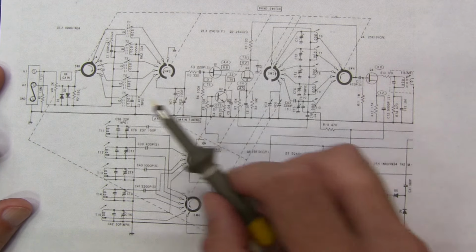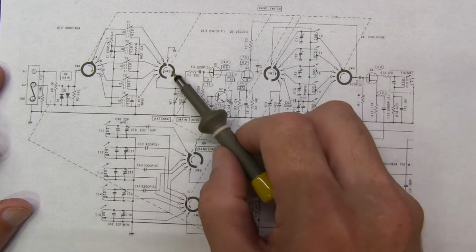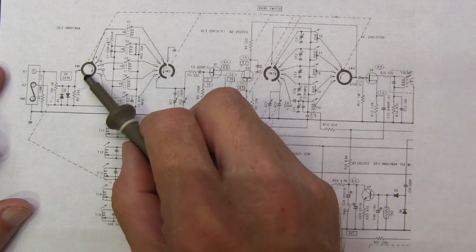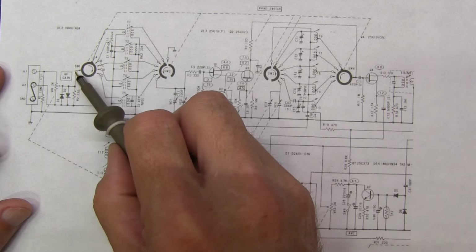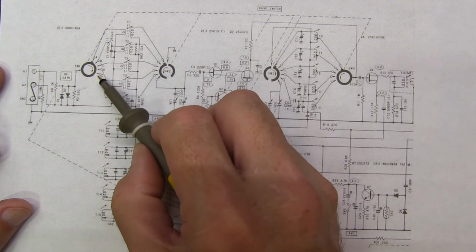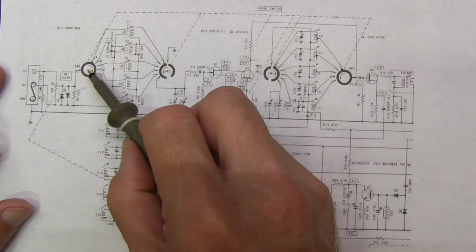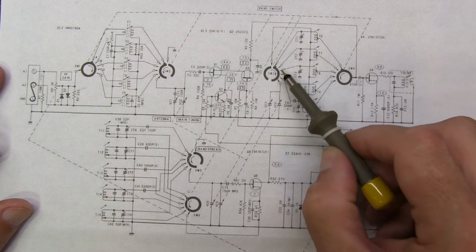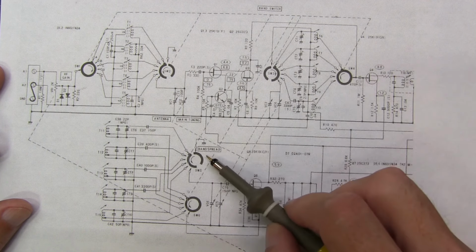What's interesting about this representation of these switches is that the picture actually looks like the way the switch is built. This is the actual rotary part of the switch that spins around. The arrows in this case are not movable. Those are representative of the contacts. So think of these dark rings, either the full rings here or the semicircular rings here, as conductive elements, and that is what gets rotated around.